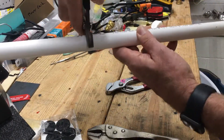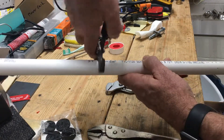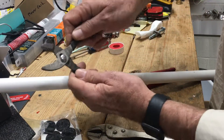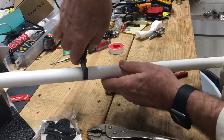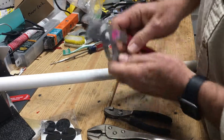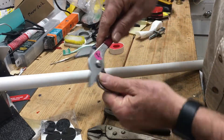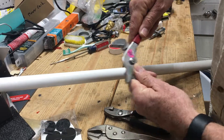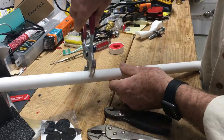Regular pliers — if you do this, you can see that's just too big to get a good bite on there. The pipe's too big. So what you do is you open up all the way and slide that, and that opens the jaws more so you can get a grip on something. And then you've got channel locks — some of them are called sliding channel pliers — which is the same principle. You can't get a bite on that, so you get it to where it's the right amount and then you get it.